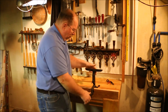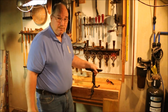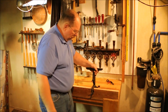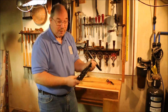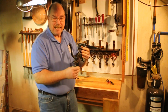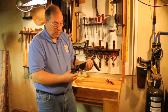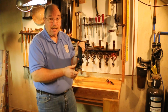When you're looking for a saw vise, having one that tilts is a nice thing — not all of them do, but I prefer it myself. This lever arm letting me move it back and forth makes it a lot easier to use. When I got this one home I found something a little odd about it. It didn't sit straight and it didn't want to lock down right — they had this piece on the wrong side of the casting. So I loosened it up, took it apart, put it back together the right way and it worked just fine.